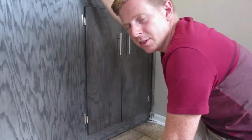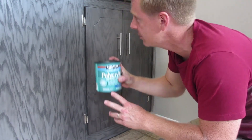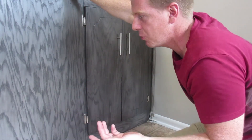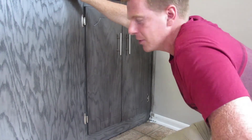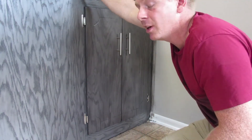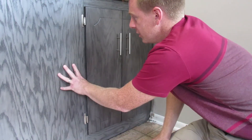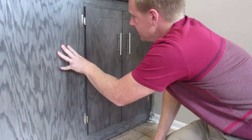For sealing, you're going to want to do two to three coats. You can put a coat on and give it a light sand with 350 to 400 grit sandpaper between coats. I don't care too much since this is going to get scuffed up - I have kids and food is going to get on it. But you definitely do want to seal them, because if you spill something on there it could stain the wood just like the stain you put on.